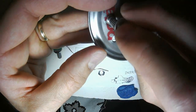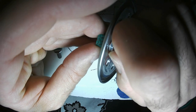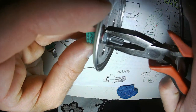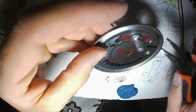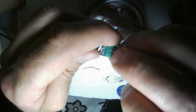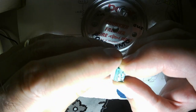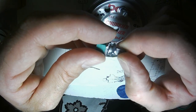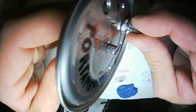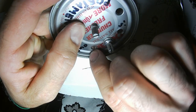They are dual gang potentiometers, which means if you want to use one of them as a stereo potentiometer to control the levels of a stereo signal, they'll work great. If you want to buy a 100K potentiometer and you need a 50K potentiometer, you can just bend the pins and make them all touch, and bang, you just built yourself a 50K potentiometer. I don't use them as often because the damping on the action is higher than I like. I like my ultra cheap circuit-snapping potentiometers, because they're so quick. But at the same time, they're not very confidence inspiring because they wobble like the bearing's going out or something.